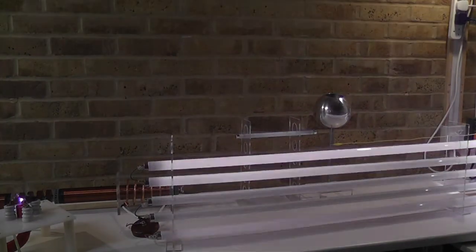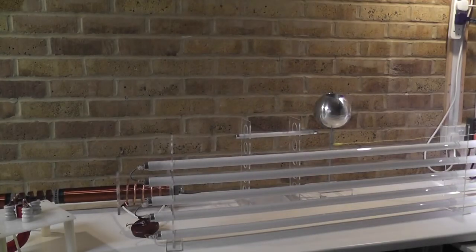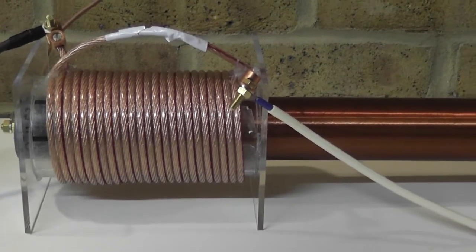Connecting now the terminal to the end of the row — it is a picture you have seen before. The bottom line and top line are illuminated but the middle is not. The pressure is only available at the ends and is not enough to go through all of the bulbs. That is going to change — I am going to show you how. I am going to replace the primary on the driving side with a Bifilar coil with very special properties.